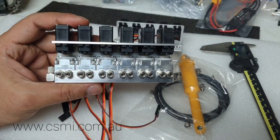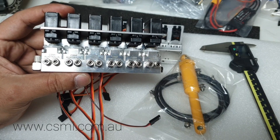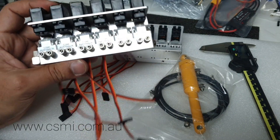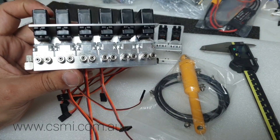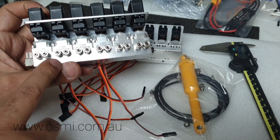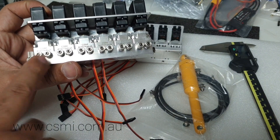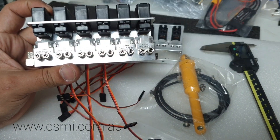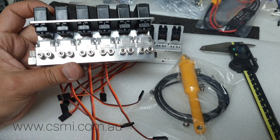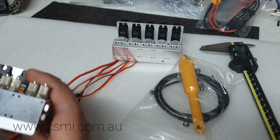All the fittings are available on the website. These valve blocks are quite well designed — they've got a high torque servo built in so you can precisely control the fluid pressure to where it needs to go on the cylinder. It's got directional flow, so you can connect the hose on either side and it doesn't matter, because one side will return to tank and the other side will be pressure to expand the cylinder, or vice versa to compress it.